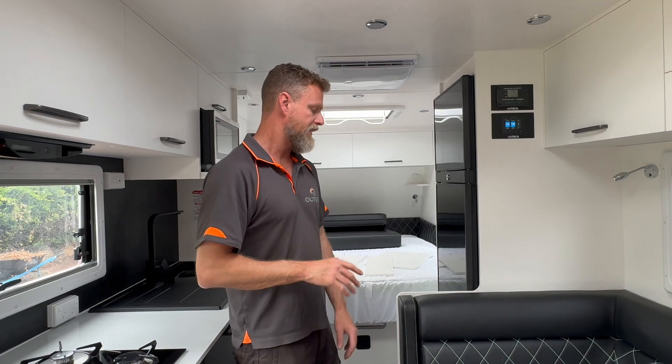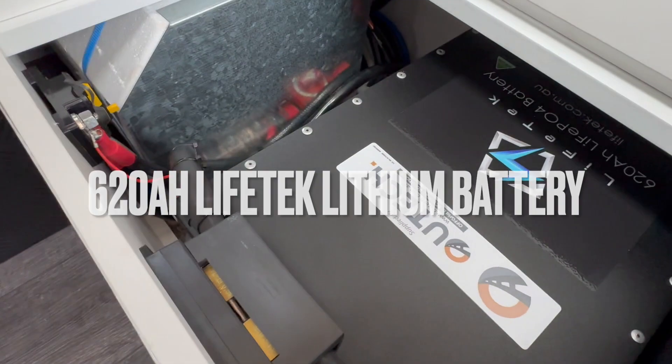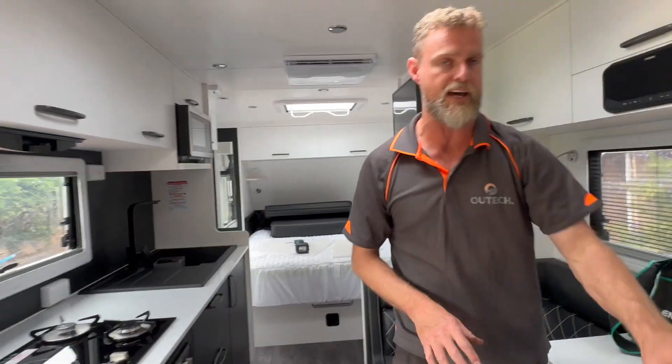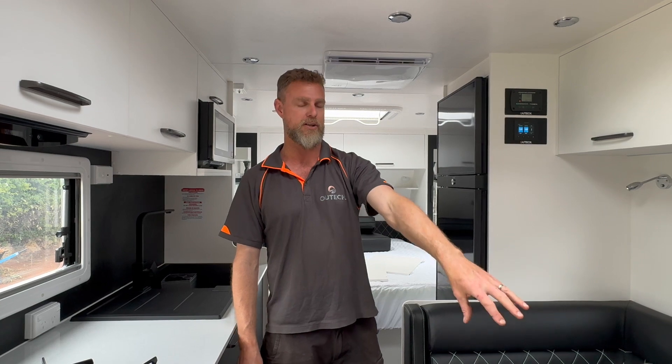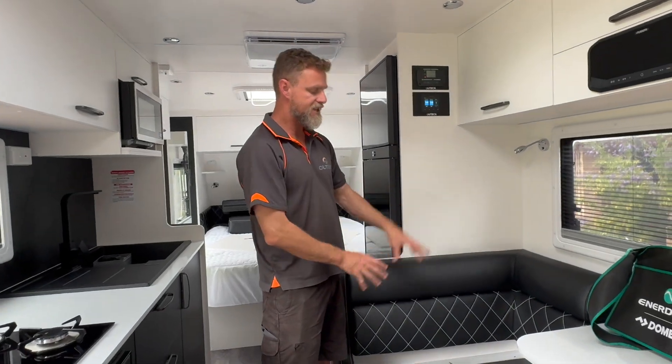We have a 620 amp-hour battery underneath this seat, and as you can see it is very full in there. With all of our compliance requirements, that particular battery is fully enclosed and vented outside. The enclosure the battery is in is vented to the outside. The battery is a Lifetec battery, so it comes fully sealed with the ability to have a vent hose attached. We've got battery isolation fusing, circuit breaker isolation over that side of the seat box, and all of our chargers, DC-DC, and monitoring.